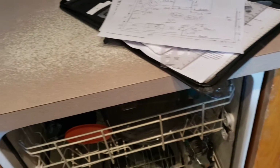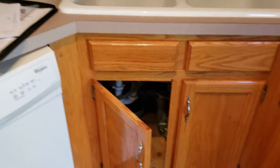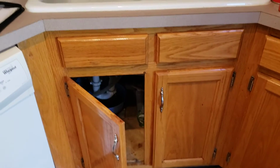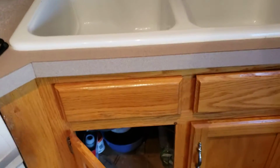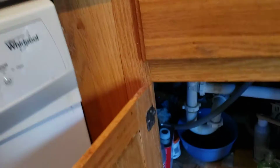Of course, the dishwasher is 24 inches, so you're actually going to end up having a small panel to the left and a small panel to the right. Now, with this being a corner angle sink, there are 2 or 3 different ways that they make these sink angles. This way is actually what is considered a loose face frame. They call it a CFO, cabinet front only.